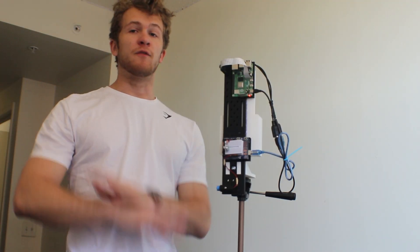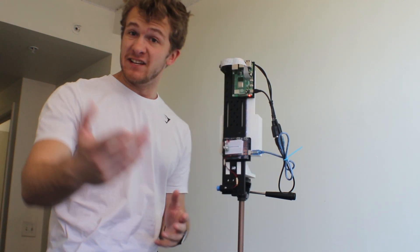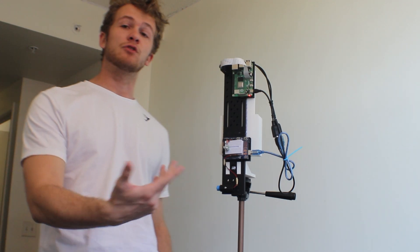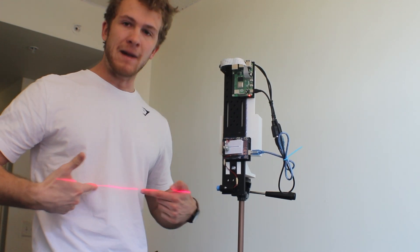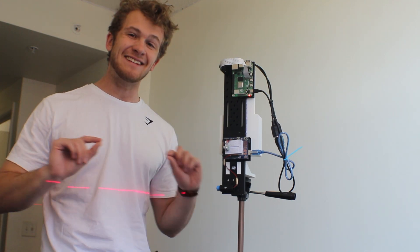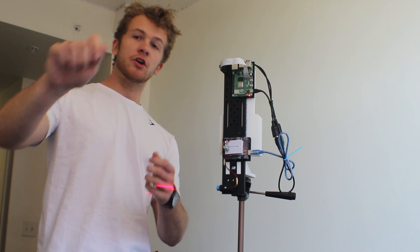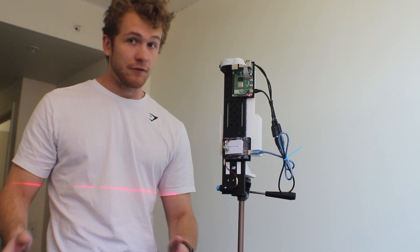The LiDAR actually had to be calibrated before we could deploy it. Before the calibration process, we need to make sure the LiDAR is properly set up. The first thing is to set up the laser — check how sharp it is by turning it on and projecting it on a surface. Adjust the dial on the end to make sure it's as in focus as possible. You'll know it's in focus when the laser line is as thin as possible. Once sharpened, wrap tape on the dial so it remains in focus for all your scans.